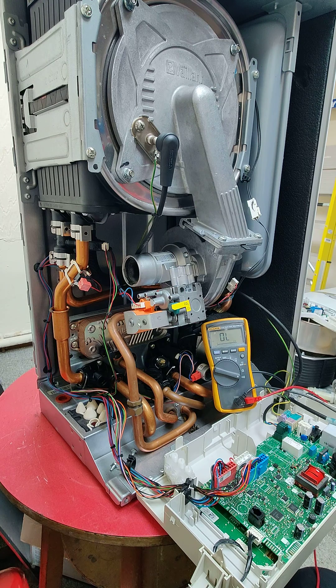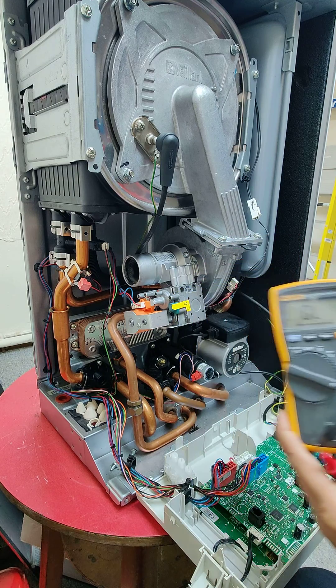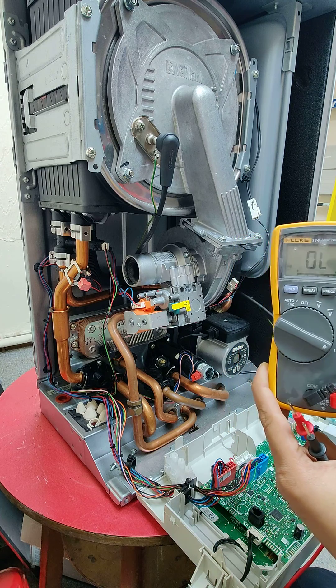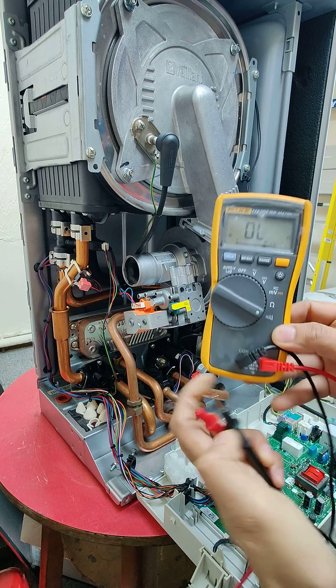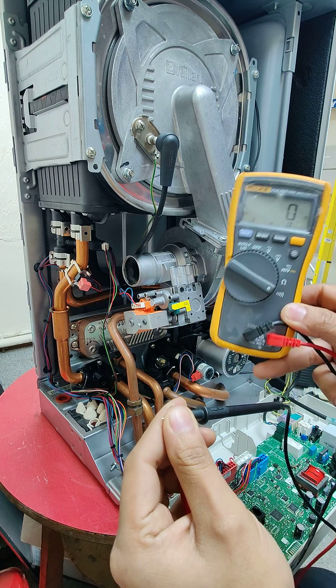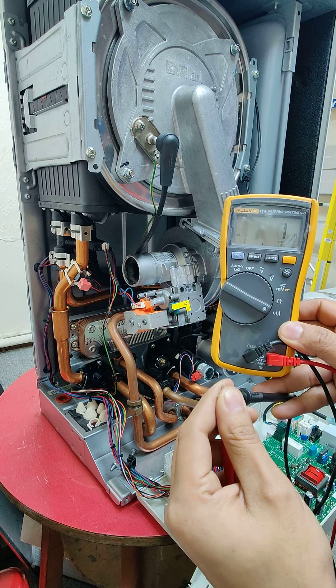This is a quick video to demonstrate how to check your wiring harness for continuity. It's not a full wiring harness we're going to be testing, just a couple of components to demonstrate how it's done. For that we need a multimeter, and we need to set it at the right setting. For this exercise we can simply put it on the buzzer setting, where when we connect two probes together it gives us a continuous sound — that's the continuity buzzer.